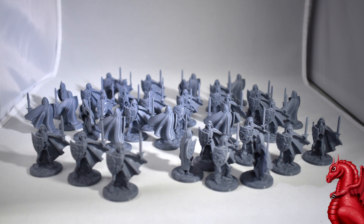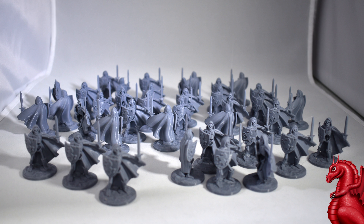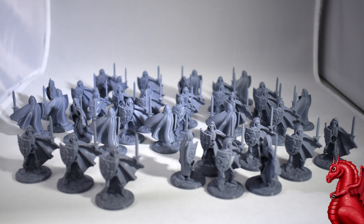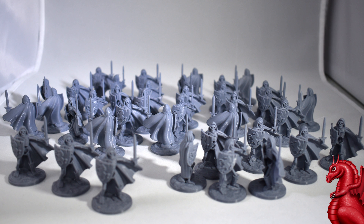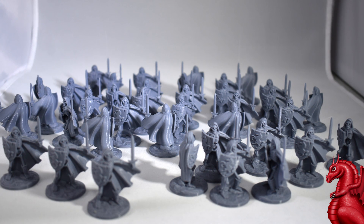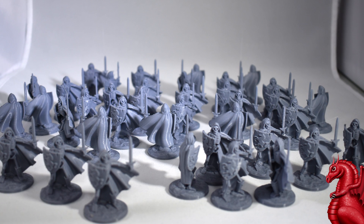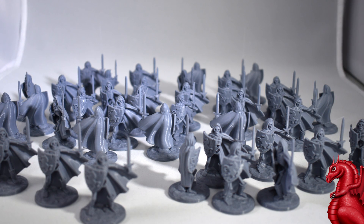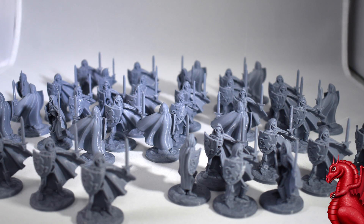Don't let the whole magic number thing scare you into using the wrong layer height. Some miniatures will print better at 0.08 or 0.12 and that's something you have to experiment with — this is just this particular sculpt. I did about 40 prints of it and tried four other sculpts just to make sure I was getting consistent results. But for me, I stick with 0.1 initially for printing a miniature, because time after time it's going to produce the most consistently good results. I hope this has answered a few questions about how your motor works and how to select layer heights for your miniatures on your printer. Please click that subscribe button and thank you very much for watching.